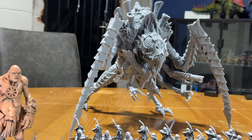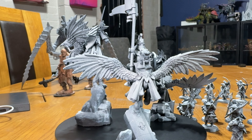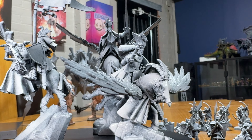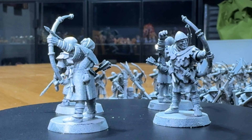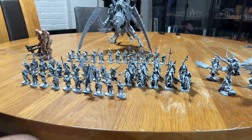There's a lot to love: great quality prints, things print very quickly, and you can fit so much onto the build plate. But there are some disappointing things. At this price point, I wish it had some kind of heating option. Heating is one of the big things that determines successful prints and print quality — when it gets too cold things start to fail, especially with this much resin in there. There are third-party options like a vat heater, or you can put it in a grow tent with its own heater, but it would be nice to have heating built in at this price point.